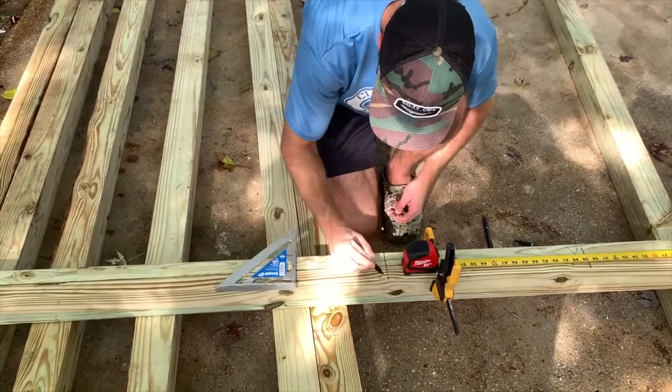Second, I would give myself a bigger overhang, probably 3/4 inch, just for a little bit more support and rigidity. I will say there was a bird that got caught in this shed and it was trying to fly out and it kept on hitting the windows and they didn't break, they held up really good. But another thing you could do is you could take a piece of blocking and just install it behind the window acrylic panel. That way, in addition to the adhesive, you have a piece of wood behind it to kind of keep it in place. But those are my tips.